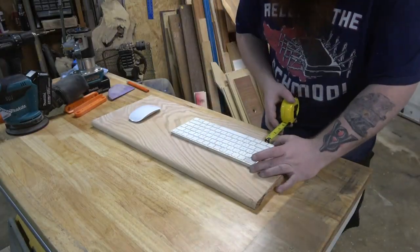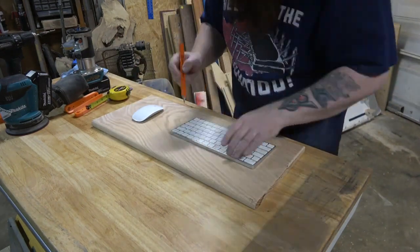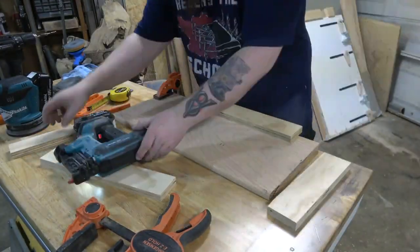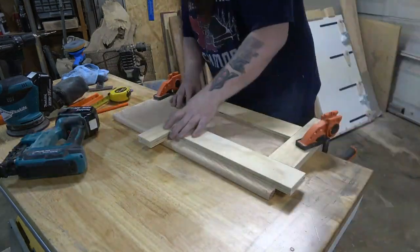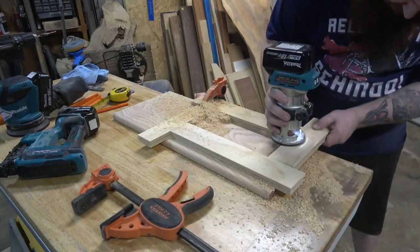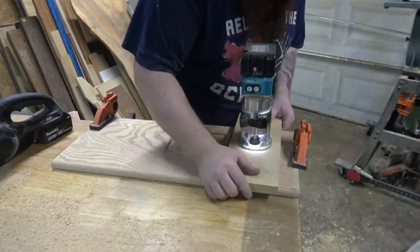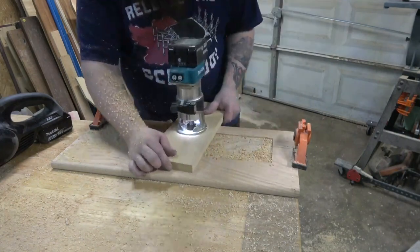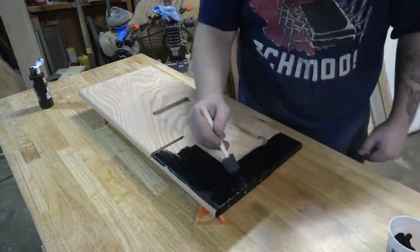While the epoxy is curing, I lay out the spot for the keyboard and start cutting the pocket. There are much better ways to do this — my CNC router really would have been perfect — but I wanted to try something different and decided to use a palm router. I quickly laid out a jig to act as a border for the bearing of the bit to ride on. Once the outside was cut, I used a long piece of MDF to make a temporary base that would allow the router to remain supported while over the large pocket. I made a couple of passes to get to the depth I wanted, and again finished it up with India ink and polycrylic.